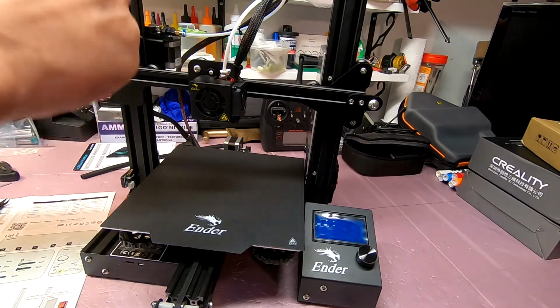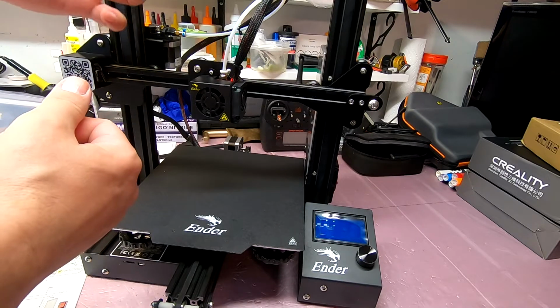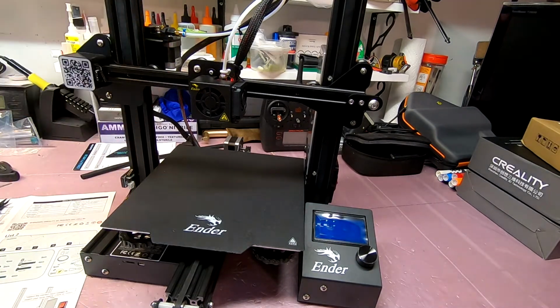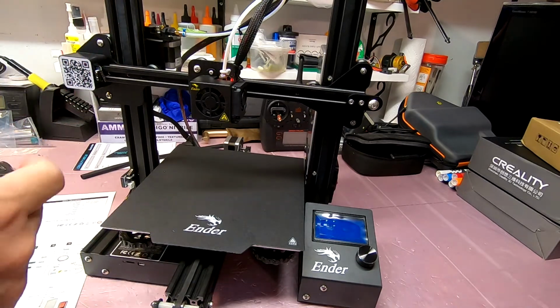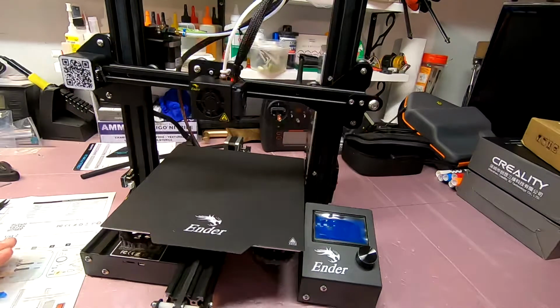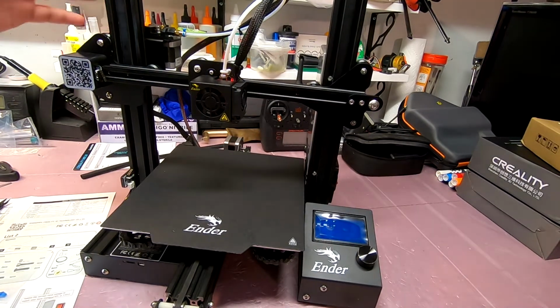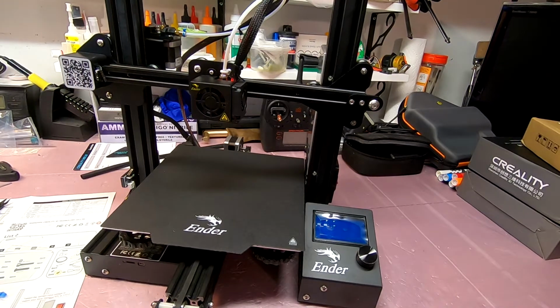So the jack screw would move up and down. There's something like a bushing screwed around the jack screw, and that would go up and down, and that would move the stabilizer. And there was a bunch of people on a commuter jet, and sadly there were people in another commuter jet nearby, and not just the pilot but passengers witnessed this plane go down because the jack screw had stripped. The threads were stripped off of it. And it failed catastrophically, and it locked the elevator in one position at an acute angle, and the plane spiraled in and killed all on board.